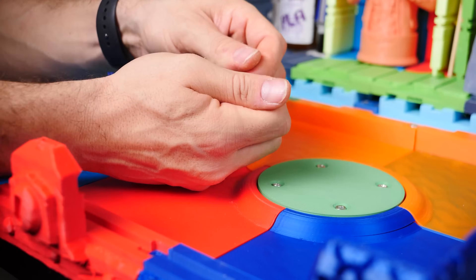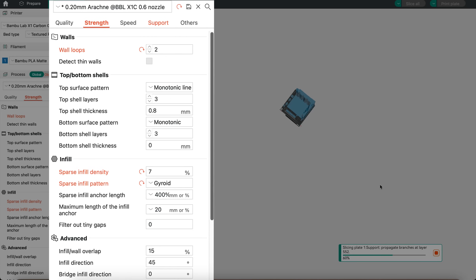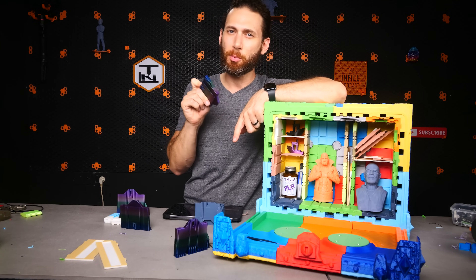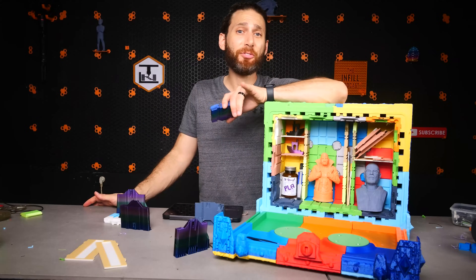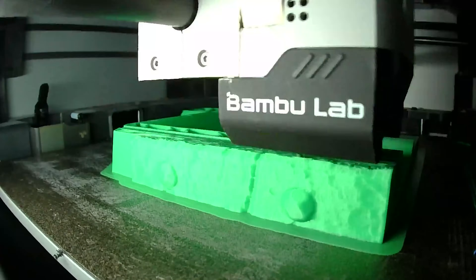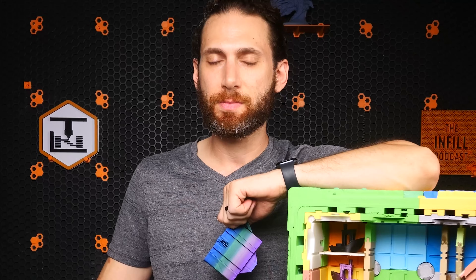Printing the parts was pretty easy, and except for a few small areas, supports really aren't necessary. I opted to go with 7% infill, two perimeters on all 0.6mm nozzle printers and three on 0.4mm nozzle printers, three top and bottom layers — though I do wish I'd done four for more rigidity. And to save on time, I booted up pretty much every printer in my arsenal. I was using almost exclusively Bambu Matte PLA, but I pretty quickly realized I was going to run out, so I began using up a lot of older or half-used spools. Let us take a moment of silence for my beautiful rainbow filament wall, and to remember the dozen or so spools that made the ultimate sacrifice for this project.